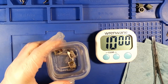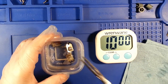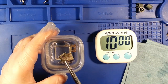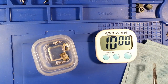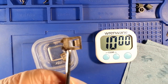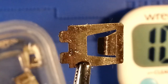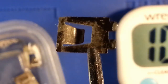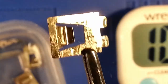Okay, I've been agitating and stirring and just soaking the parts for about 10 minutes. And it looks like the plating solution has done its task. There's no exposed copper or brass. I'd imagine this is some sort of an alloy. It's probably stiffer than regular copper. The pieces and parts that aren't nickel plated seem to have a good coating of tin on them. Seems to have gotten into the pitting fairly well.